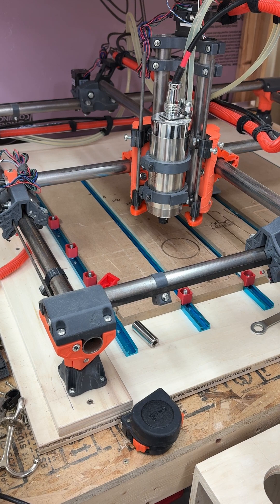Normally when I disable the stepper motors or the machine goes idle, the Z axis doesn't crash, but it did fall slowly back to the spoil board, which was just kind of annoying. It meant I really had to watch — if I put the blocker in, was there a bit in it? Did I break the bit? Did I hit the aluminum T-channel on the spoil board? So here we go — disabling motors. I can definitely hear that the motors are disabled, that noise they make has gone away. But the Z axis is still in the same place. That's fantastic.